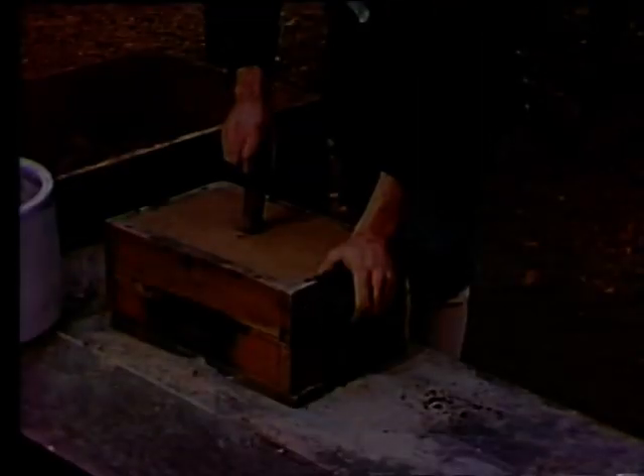A piece of wood forms the sprue, the hole through which the brass is poured. Facing sand is then placed on the patterns and the top half is rammed down the same as the bottom.